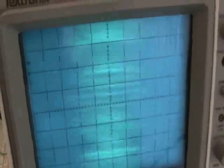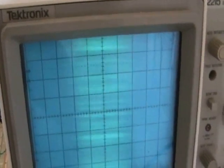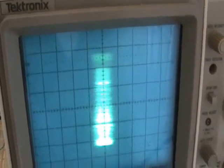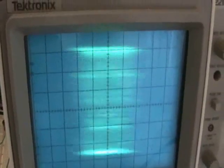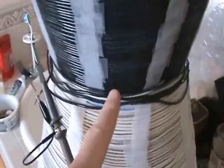Just to show that this antenna does make a difference, I will unclip it. You'll notice that the Y component didn't drop very much — I'll put the antenna on and take it off. Y goes up and down. If I touch it with my skin it goes up even more — that's human capacitance. The amplitude in the Y direction goes up a little, but we see a much more significant increase in the X direction, meaning the energy pulled off the antenna is mostly going into making a magnetic field within this coil, which kind of makes sense.